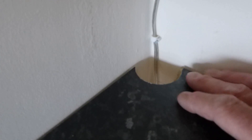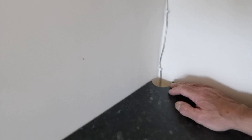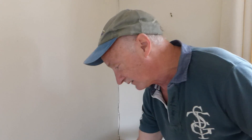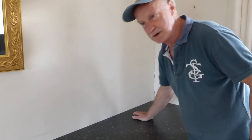As you can see, we've made a hole in our worktop round this corner. The reason for that is to drop all our wires through — monitor, mouse, keyboard, there are a load of wires and you need quite a big hole. Best to drill it before you put the worktop on — a lot easier to do it out of position than when it's already fitted. You can have your hole wherever you like; if you're drilling further in it doesn't matter and you can do it in position, but if you want it on the edge, it's best to do it before you fit the worktop.